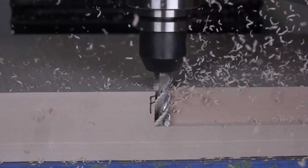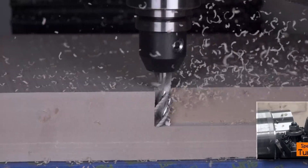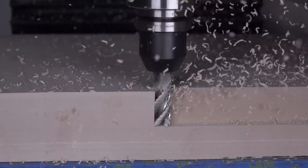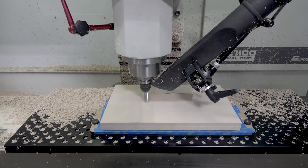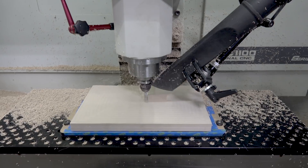It's actually a really nice chip size. And even though this is a composite material, it reminds me of the Paul Diebold video we did on lathe feeds and speeds where you really want to get those C's and sixes — in other words, we want a real chip but also one that breaks and doesn't become long and stringy. The shop vac plus the dust deputy definitely helped, but it's no replacement for a proper dust extraction system.